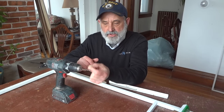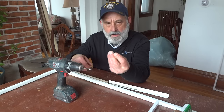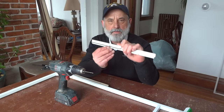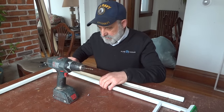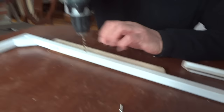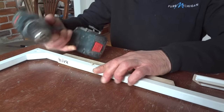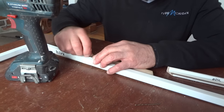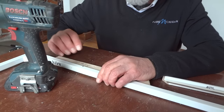Two drill sizes: an eighth-inch and a sixteenth-inch. The eighth-inch is going to create a passageway for our screw — it's a number four by five-eighths inch long screw designed to penetrate through the wall and partway through the gasket. You have to have a backing board underneath it. You're going to be drilling through the insulation material, so put the backing board underneath the insulation and drill straight through everything. Your screw is going to pass right through to bottom out, and from that point on it's going to start compressing the insulation each time you turn the screw.